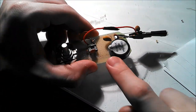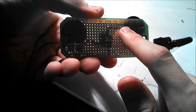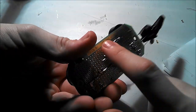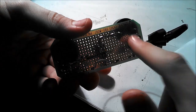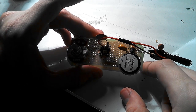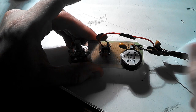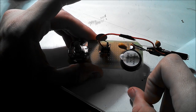To attach the buzzer — which is polarized, indicated by the plus on the sticker — the plus side connects to pin 7 of the IC, which you can connect by soldering it underneath. The ground connects to the ground bus. You can solder this in wherever space allows, but the instructions suggest placing it right about in the center, so that's where I put it.